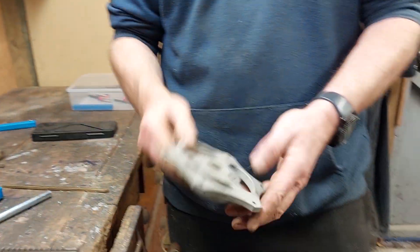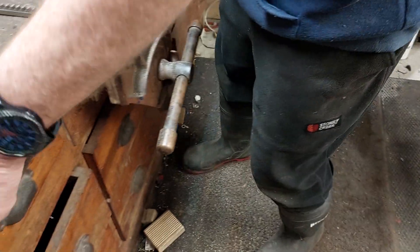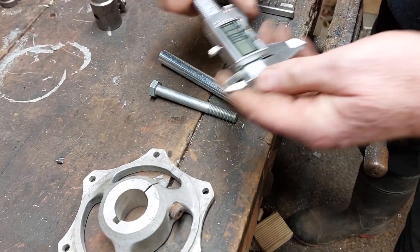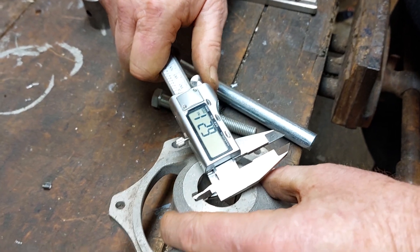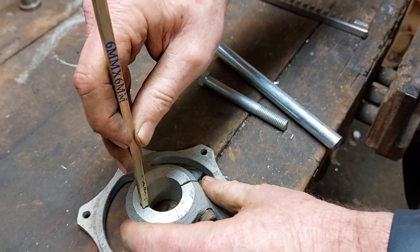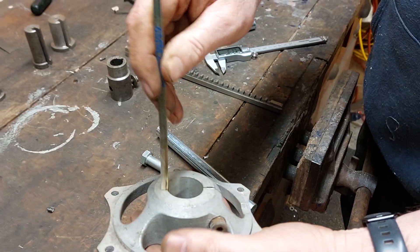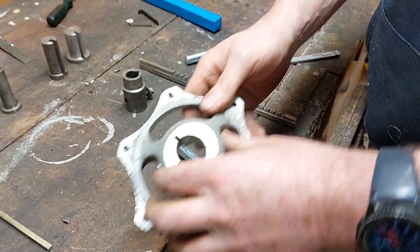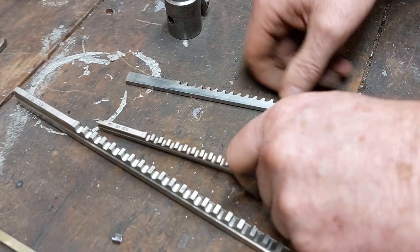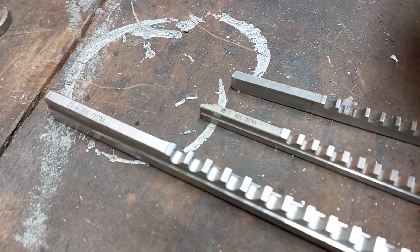What we're trying to achieve: this is a gear carrier and you can see it's got a keyway cut in the side of it. I'll grab my verniers, turn them on, and measure — it's basically close to six mil. So this is six-mil key steel and it should just slide in there nicely, which it does. We're trying to cut a groove down through here to match the groove in the shaft. The way we do this is with these things called broaches. I've got three different-sized broaches here — there's a three-eighth, a five-mil, and this is a six-mil broach.